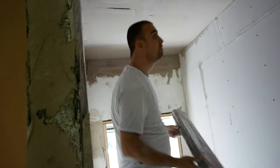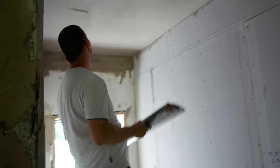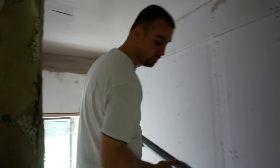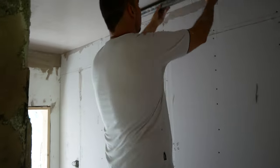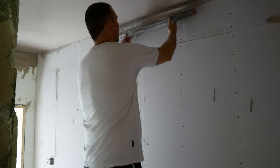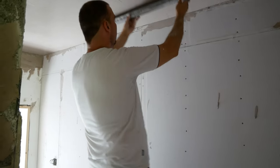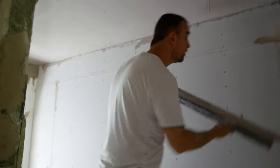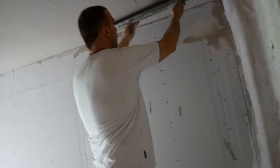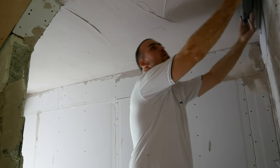It's a lot quicker hitting one of these than it would be with a trowel. And again, I do trowel it all again pretty much straight away. I'll maybe wash up my hawk, wash up the spatula, make sure the bucket and drill is washed, and then trowel it up straight away. If I have somebody in help me, or part of a team, I would just start channeling straight away back onto the first ceiling or back to where it was first coated and start channeling up.